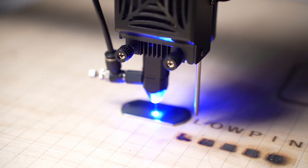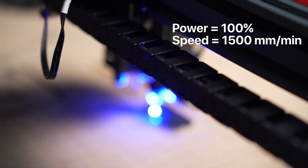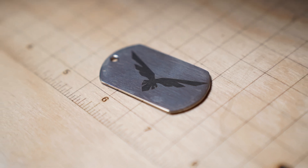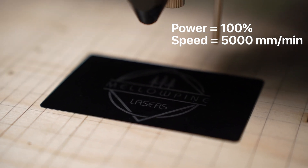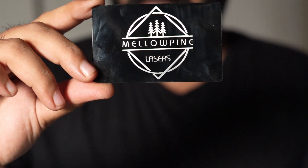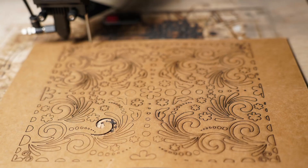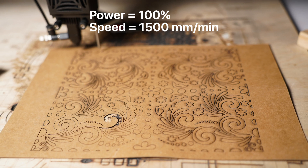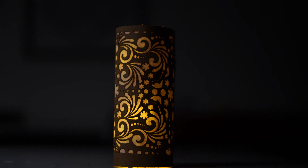I engraved a stainless steel block tag and the results were good. I used 1500mm per minute speed at 100% power and the engraving had good contrast, looked sharp and dark. I also used 5000mm per minute and 100% power to engrave on a painted aluminum business card — the laser removes the paint coat to reveal the metal underneath, and after wiping it off, the engraving had a good shiny finish. I also used the TS2 to cut 1mm thick cardboard at 1500mm per minute at 100% power, cutting a design to form a tube and make a candle shade that throws patterns onto the walls.